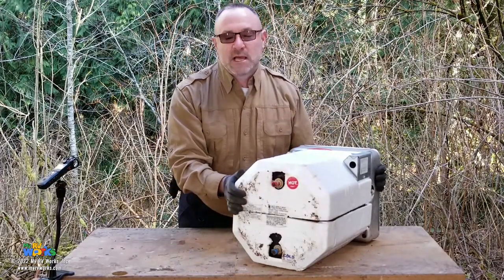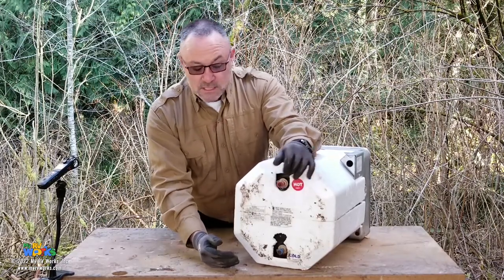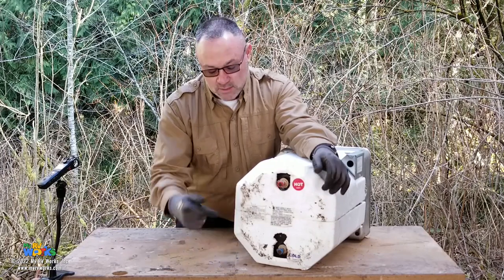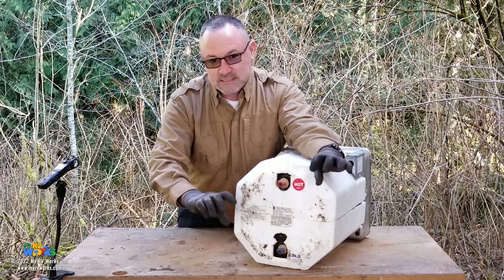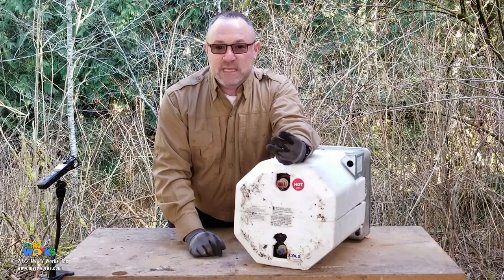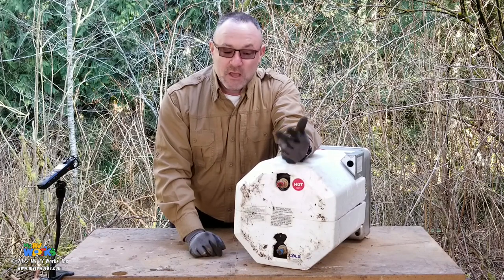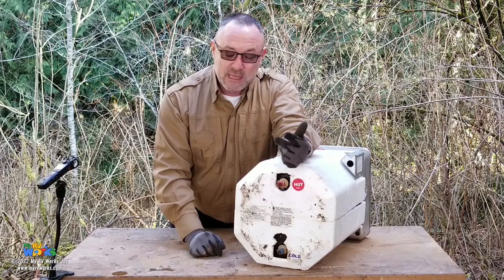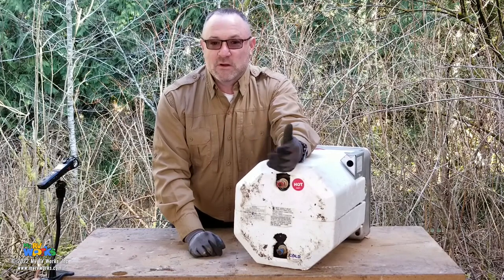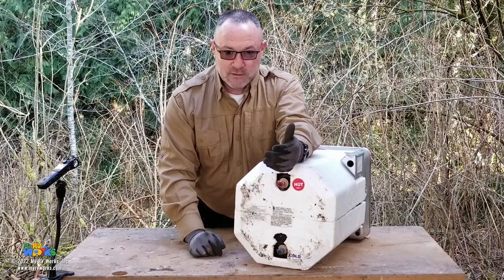Most of the time, you're going to have a bypass option on your water heater. Some of the Suburban water heaters have a thing called a motor aid. The motor aid is going to have two little bullhorns sticking out of it that are also aluminum. So that makes a third way to heat your water. One way to heat your water is with an electric heating element. Another way is with a flame from LP. And another way is with the motor aid. Certainly not as efficient as gas, but it's another way to heat your water.